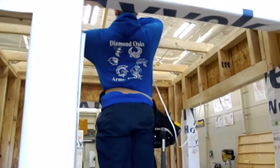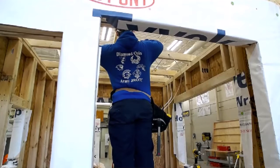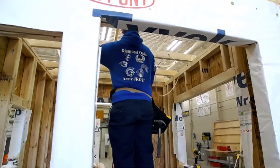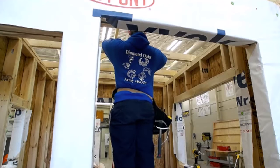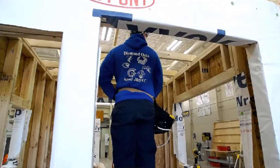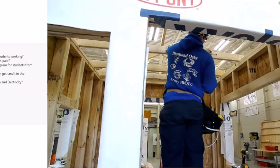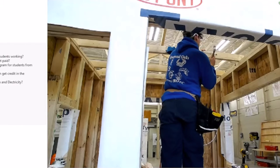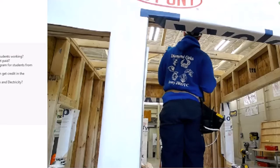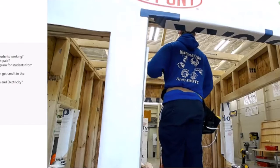When you're building a house, when do the electricians come in? Great question. The electricians usually come in after the heating and air conditioning and after the plumbers — their stuff is a little bit larger than ours, and they have certain things to do to ensure proper drainage and airflow, so they get first choice of where everything goes. We come in afterward and start routing our cables.